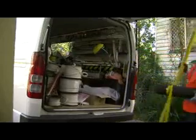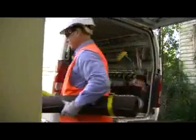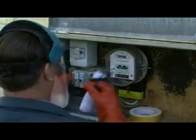Before beginning, electrical safety is always the priority. Wear the appropriate PPE for the task. Firstly, remove all power to the switchboard by removing the service fuse at the power pole or pillar box and test to ensure the switchboard is de-energised and isolated so that it cannot be inadvertently re-energised.